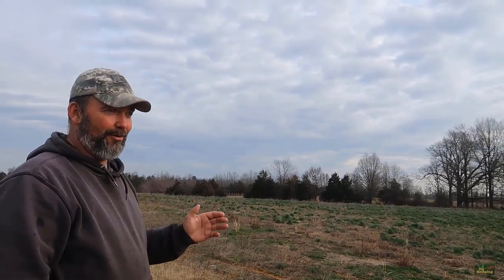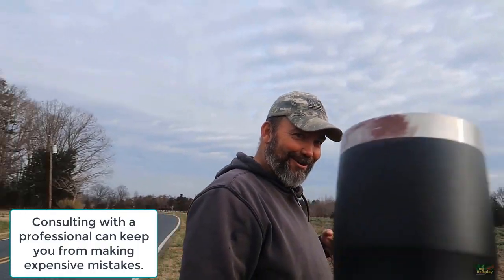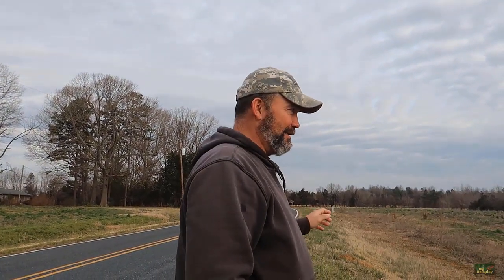Gravel does 80 feet, and it's 330 a load. Biggest reason I'm telling you that. Oh, that's a lot of feet right there. That's a lot of feet. Okay. So if you come off here, you're cutting that distance in half. Yeah. So if it's a budget issue where you're trying to get into the property on a budget, then you need to come in from this way instead of that way, because you're doubling the cost in grading, and you're doubling the cost in stone.